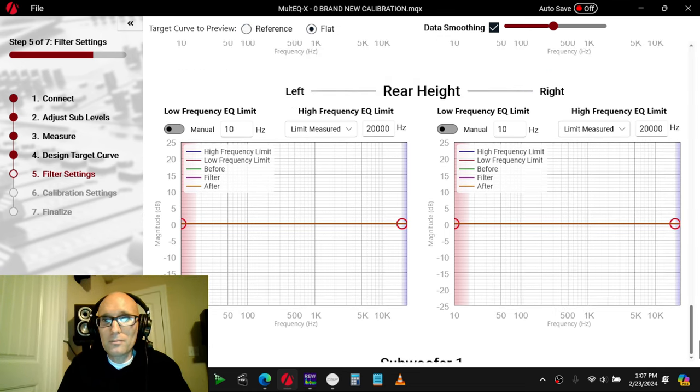And we don't want that. So we now want to cut this off. When you EQ in this way, because you're bringing down the subwoofer's floor closer to this part, this is where you can get into seriously crazy bass, and you have to take care of this, because you could honestly damage your speakers if you don't take care. Number one goal: my subwoofer's original roll off, I must equal exactly the same. Then I know my subs are safe.